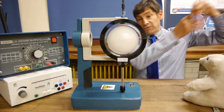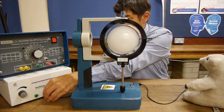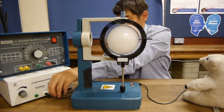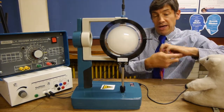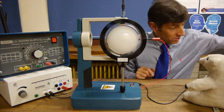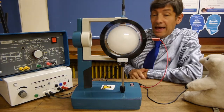I was always taught to wire up experiments in front of students. So let's make the filament 6.3 volts — that'll make it nice and hot so electrons will boil off it. We've got an accelerating anode halfway down the tube that we'll make positive, connected to a high voltage power supply. And we'll bias the filament with a negative voltage to force the electrons off it. So we've now got our accelerating voltage and our filament wired up.